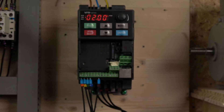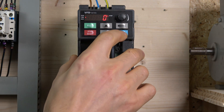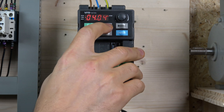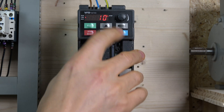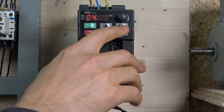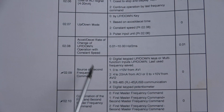As you can see, the two settings we need to select for up and down inputs are 10 and 11. You don't have to use the same inputs as I do — you can assign them differently if you prefer. I've assigned inputs three and four, corresponding to settings 10 and 11 respectively. That is the setting to remember when assigning the inputs. This is actually the first drive I've worked with that has such an extensive number of options for how the up/down function can work.